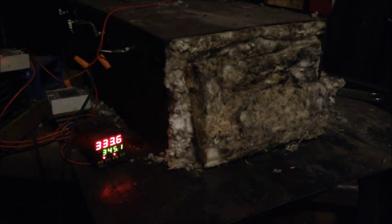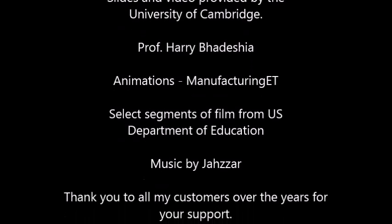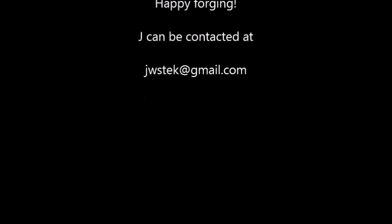The time and temperature at which we do this varies upon the thickness and the composition of our steel. I typically do more than one tempering cycle, starting at a lower temperature and slowly raising that up by about 25 degrees each cycle until my desired toughness and hardness have been reached. It's also important to point out that you should never temper at too high a temperature, because you can actually embrittle your steel at temperatures above 500 degrees. My name is Jay Stekervitz — thanks again for watching. We'll see you next time.